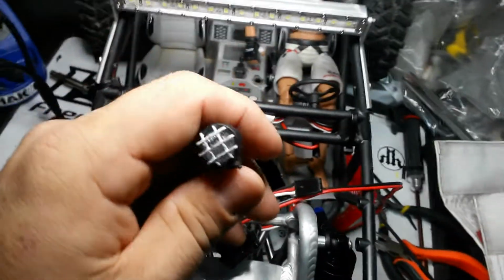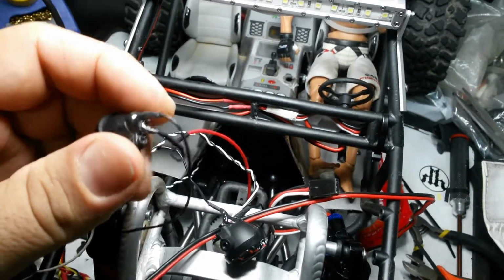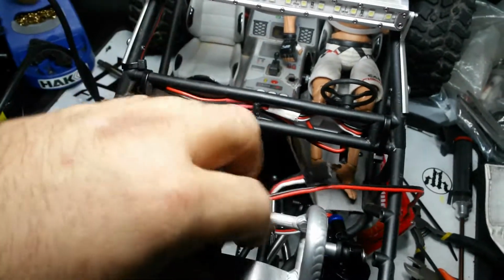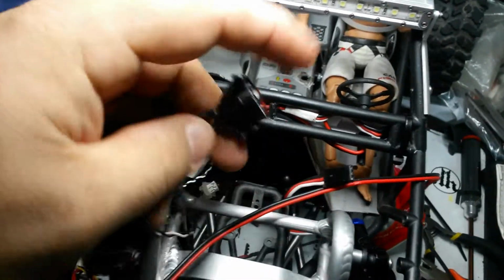And a lot of times when you're troubleshooting that one short, you end up breaking another wire because they are so flimsy. So what I recommend is go ahead and throw some Amazing Goop or shoe goo on the back of it, just like these are here. You can go to each one here and you can kind of look at what I just did. You see that there? Yeah, and it works really, really well.